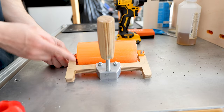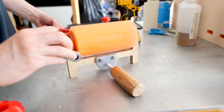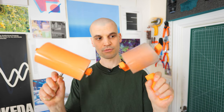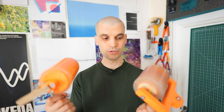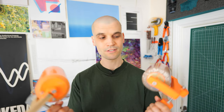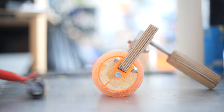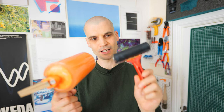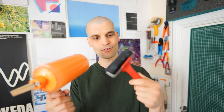I've been able to make two brayer rollers with about a third of the polyurethane rubber left over — that kit cost me £24. In the UK the biggest hand brayer rollers I can find are 64mm diameter; these are 80mm diameter with a 250mm roll-out length, which makes it much easier to ink up your plates. Compared to the original small rollers that came with my printmaking kit years ago, the size difference is huge — those are just really annoying to ink up; after one pass across a plate the ink is completely gone.